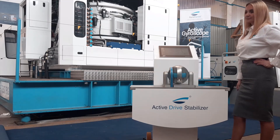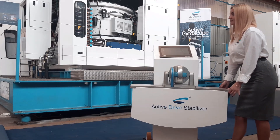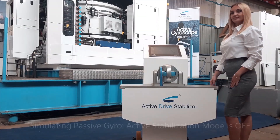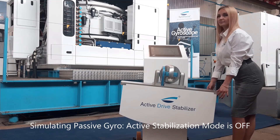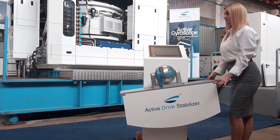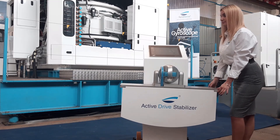It is a technique that has been successfully deployed by a number of producers. The more vigorous the roll, the more the gyro moves. However, if we wish to apply the same approach to a hull that rolls at a long period, as would be the case with a large ship, the gyroscope does not always move. We also see the gyro fails to respond to very low roll.